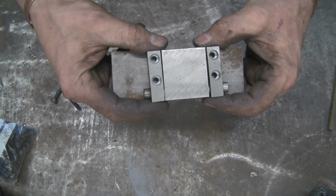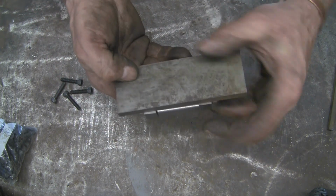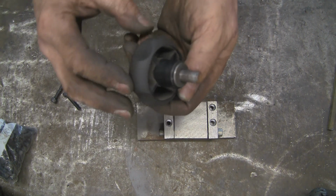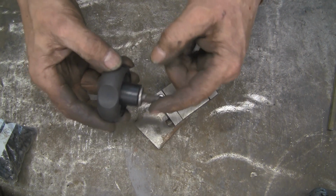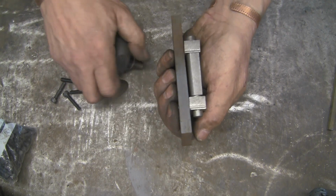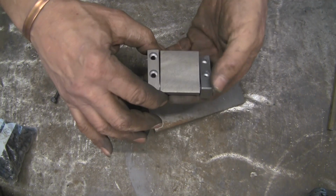So that, I think, is just about it. It will go on a piece of bar similar to this, obviously longer. And I say, once I've got the hole in the middle there with the wheel on it, in the back, when it's on the bar, I'm going to have to put another threaded hole in the back there for the actual adjuster, which is something like this. This is one I found in a skip, but I've got a couple of these. It will go through the back. I'm going to make one longer, have the thread longer, and have a spring on there, quite a strong spring, so that hopefully it won't adjust itself with vibrations, so I can move it in and out and the spring will stop it undoing or doing up on its own, and it'll just move it in and out, hopefully adjust the tracking. That is the theory.